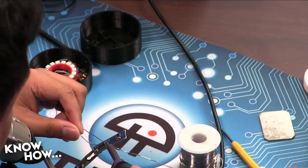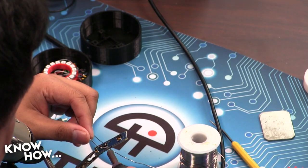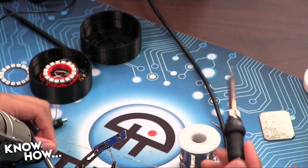Okay, so I'm going to do the same thing. I'm applying heat to the wire and to the junction, not to the solder itself. Ta-da!